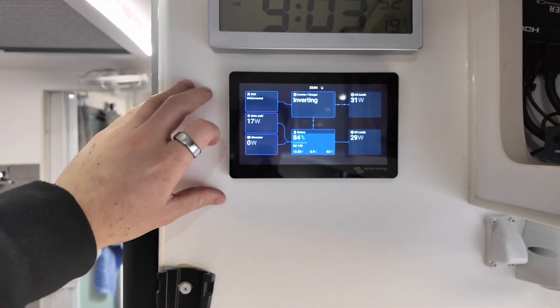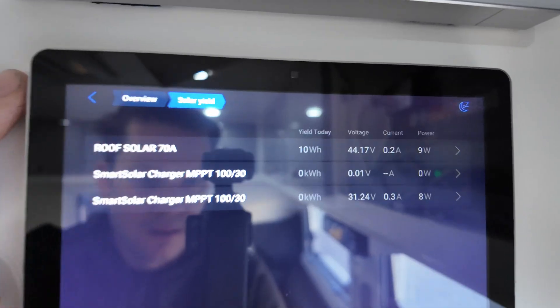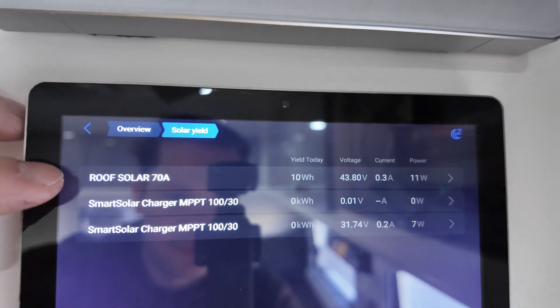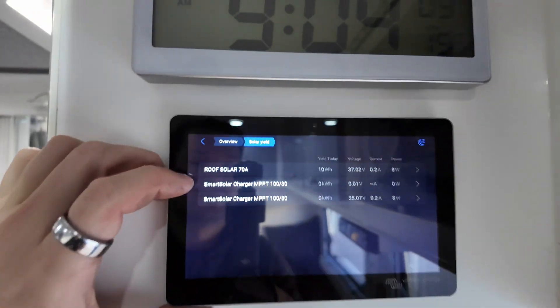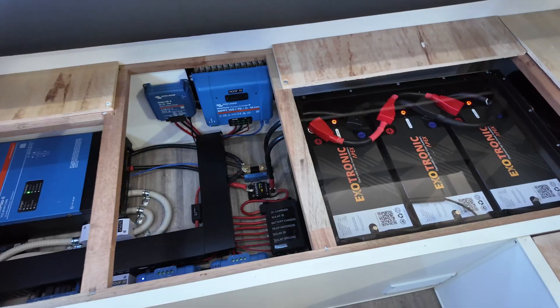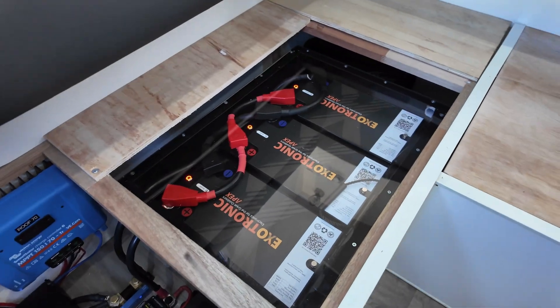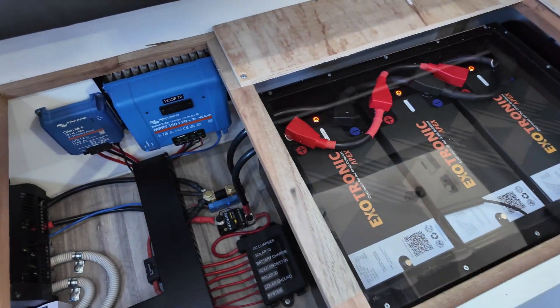Massive solar on the roof — we have seven 225 watt panels. I'll jump up on the roof in a sec. We're not getting much at the moment because it's in the shade, but everything is in series. On the solar 70, we'll be getting up to 100 volts, and on the two panels at the front we'll be getting up to around 40 volts, and there's a third circuit for the blanket plug-in. We have three 300 amp-hour lithiums — so 900 amp-hours of power — in a sealed battery box with a vent down the side and a Perspex lid as per the customer's request.